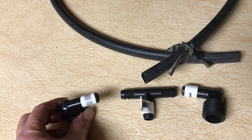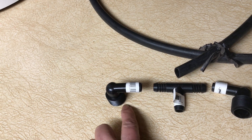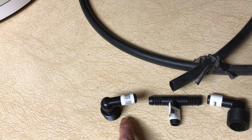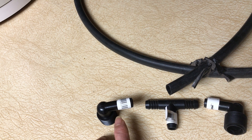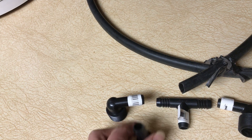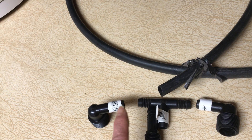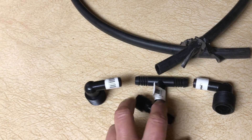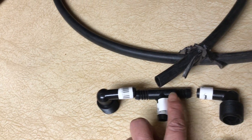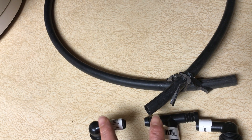You get the size you need to come out of the sprinkler head where you want to add a line. So you've got your PVC underground coming up, and you figure out what fitting you need — usually, depending on your sprinkling system, it's a half inch coming up. You can use a straight one if you don't mind raising the sprinkler head, or you can use an elbow, which is what I did because I didn't want to raise up the sprinkler head at all.